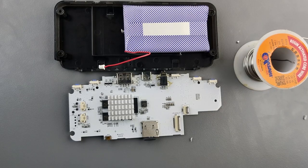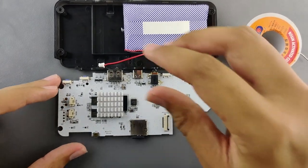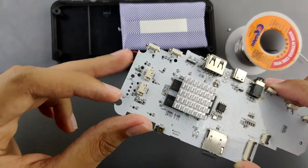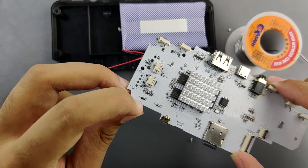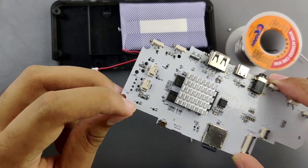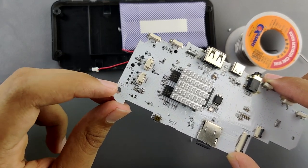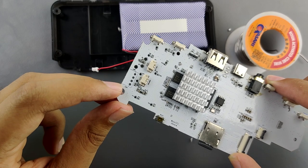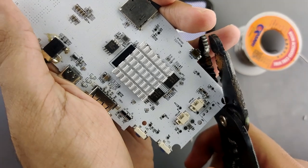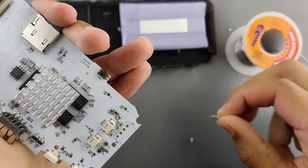Now we have a heatsink on the PCB. We're going to test fit it. A slight modification I need to do to the PCB is cut this piece off so that the Nintendo Switch speaker will not sit against the PCB and press on it — otherwise the start and select buttons would be too stiff to press. This is all ground copper, so it will not ruin the device. Clean cut.